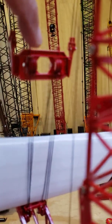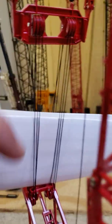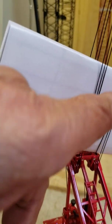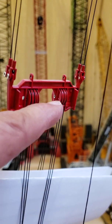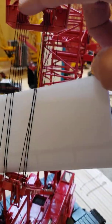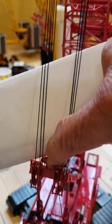Here's the kind of tricky part. As it's coming around this way, after this third one it's going to come down to the equalizer on this side, over to the other side, and then back up to this inside pulley here. Coming around to here, it's just going to come off of this first pulley here and down to this first one over here on the inside.